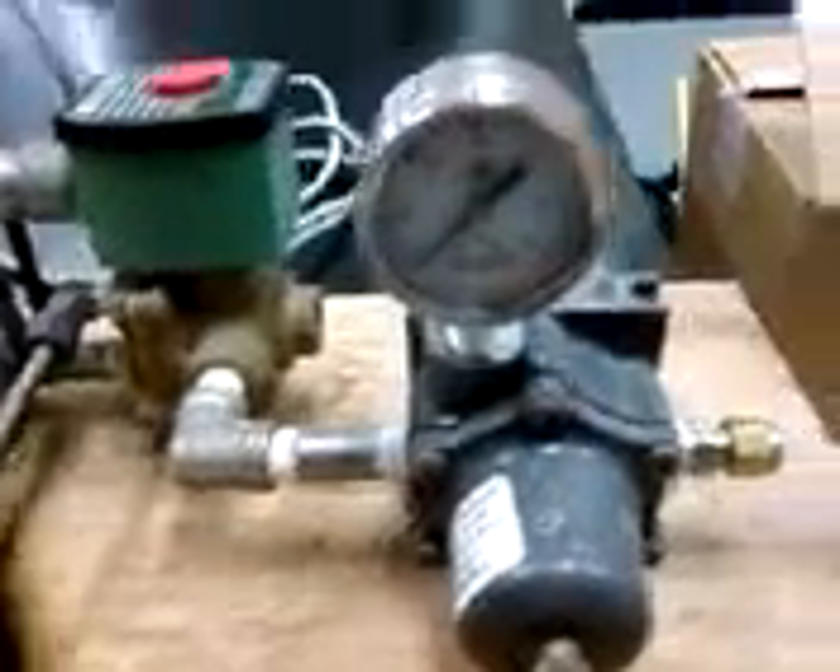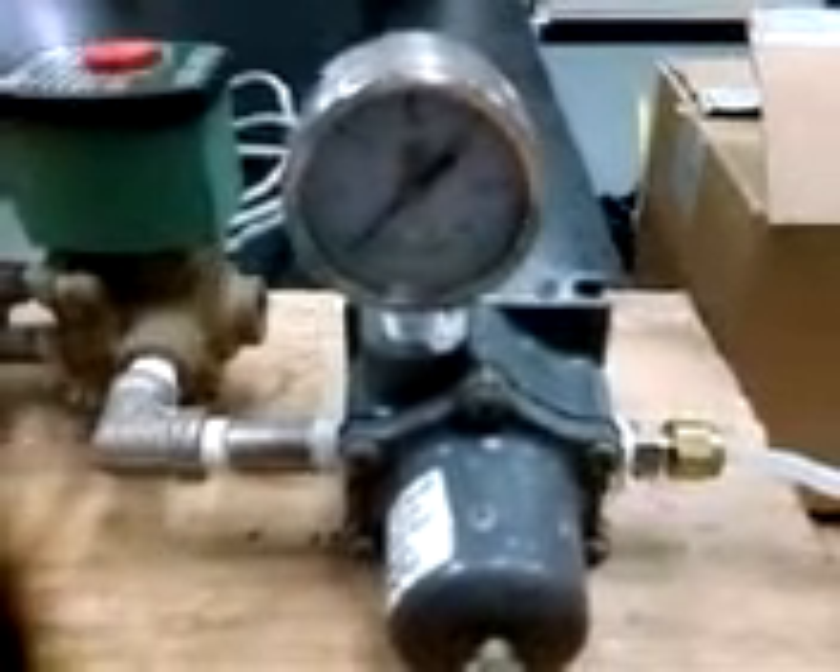With that said, I can open the air valve on the compressor and put a little bit of air in to see what happens. Before I do that, let me show that I'm properly aligned here. I want to be close to the limit switch — a little gap of about two millimeters or so — but not too close, because if the magnet touches the limit switches that's not good for the project. So I'm using about two millimeters distance between the magnet and the limit switches — good enough for the magnet to be sensed by the limit switches.